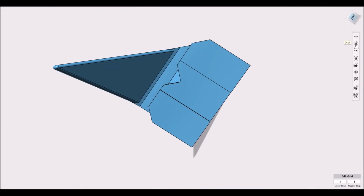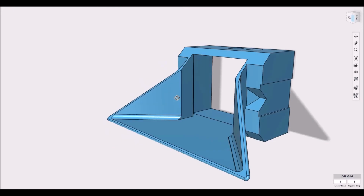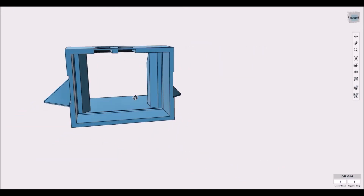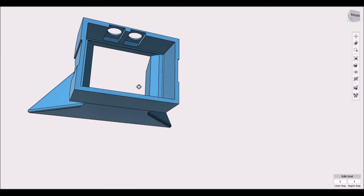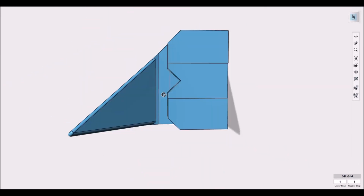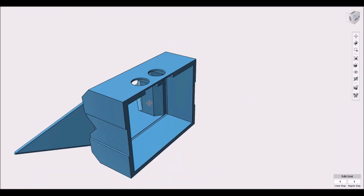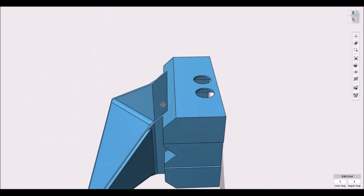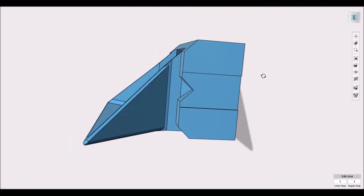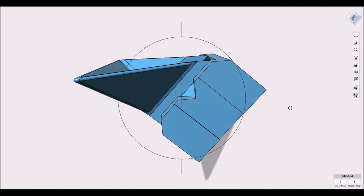This little bracket holds a third passive infrared sensor. This sensor is aimed above the cat to detect people. It has a much wider field of view so that it can be used to lock out any of the other sensor activity. Now, it will get mounted at an angle pointing up so that we can actually look upwards where the people are, like this.